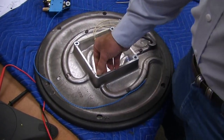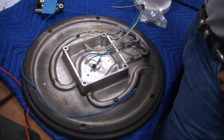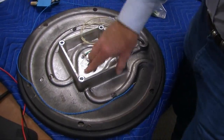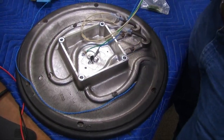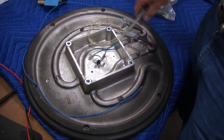When you remove the platen, these are little seats. Remember I told you about the lock, the self-leveling 3/4 6 bolt or 3/4 10, whatever that is. It sits and uses this as a wear point. These are siliconed in just to hold them. Make sure these are back in there. You don't want the pressure being applied to the aluminum underneath there. It'll start malleably deforming.